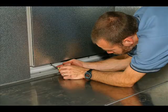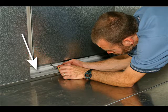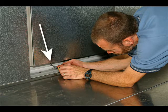The sweep gasket was factory installed and tested for proper operation before shipment. It features a unique cross-section design to not only seal the gap between the bottom of the walk-in door and threshold or building floor, but its offset configuration closes an opening that is normally created at both ends of a conventional sweep gasket. It is attached to the lower edge of the walk-in door assembly with a ¾ inch panhead sheet metal screw and flat washers.